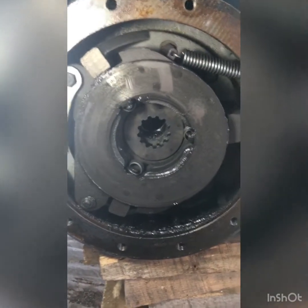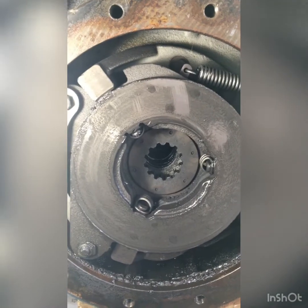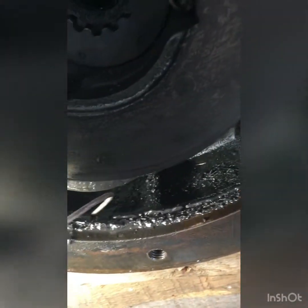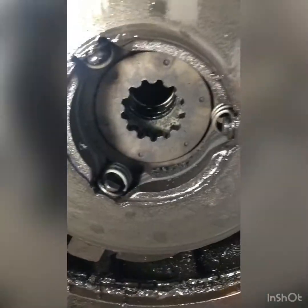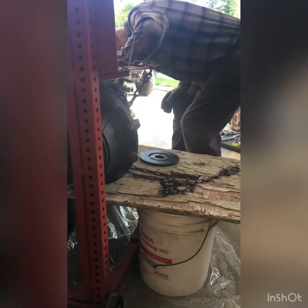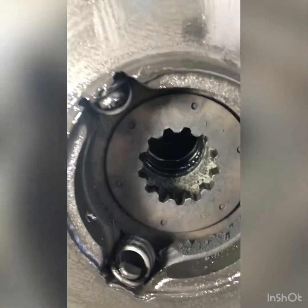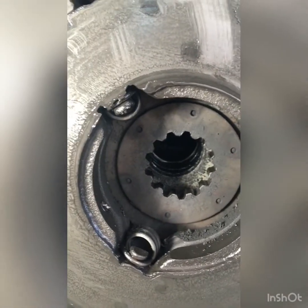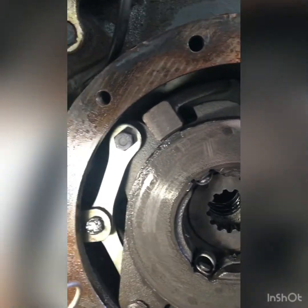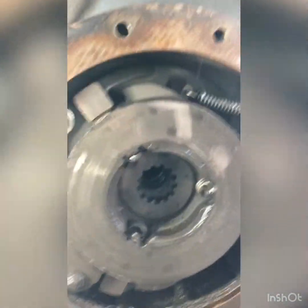Okay, so we're on the right side, so it's about the same thing. It's greasy, and normally it should be dry, and as you can see there's a lot of grease and oil. As it was on the other side, the disc on this side was totally wet, and the disc inside, this one here, looks totally dry. So again, the leak seems to come from the wheel planetary. So we'll continue, and again the boot is right here, totally worn out. That's it. See you later.